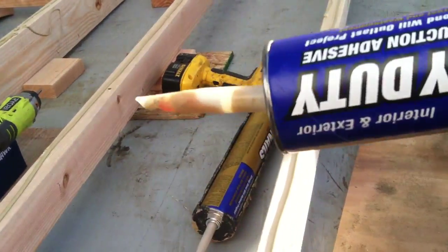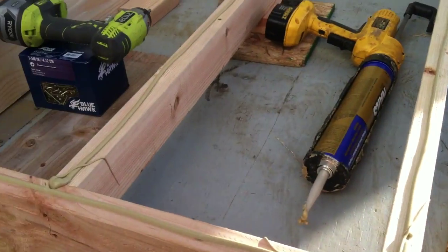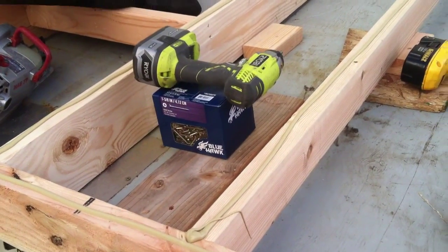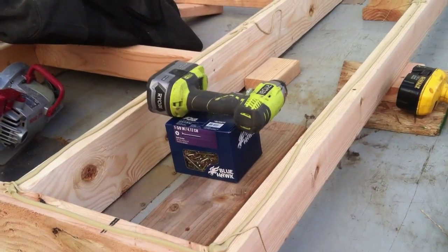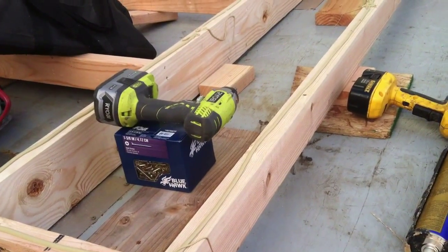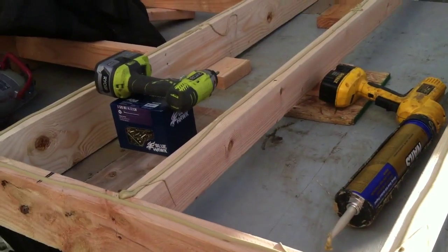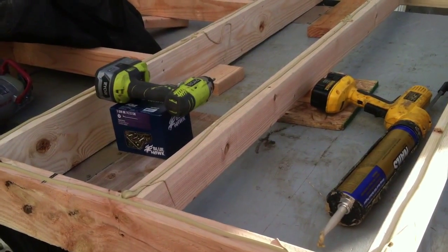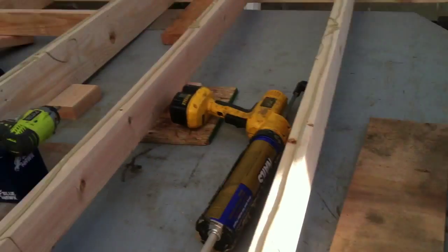The plunger overrides every once in a while. Once you pop the tube you've got to use the whole thing, so on a build like this that becomes important. You are not wrong to use nails at this stage — I'm going to use screws because I bought a big container of them, but if you have a nail gun you're not wrong to nail it. One of the reasons I'm screwing instead of nailing is this is going to be in an area that has a lot of temperature fluctuations, and screws are less likely to come out than nails. Once that glue dries, I could even back all my screws out and use them in another part of the project.